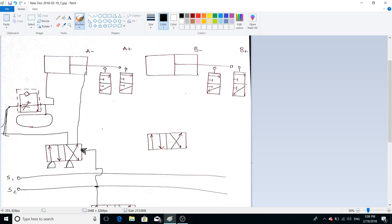This unit over here is the delay valve. We have an accumulator — this one here — and we also have a check valve and a flow control valve. What happens when the piston starts retracting: the air flows through the check valve, the ball lifts off its seat, and the compressed air falls back into the reservoir from this line. Here we have achieved the A-minus position of the piston.